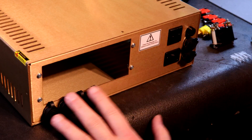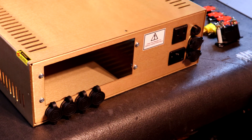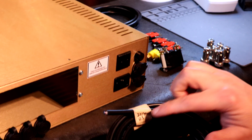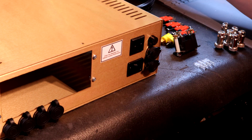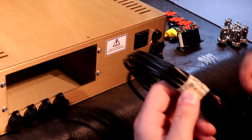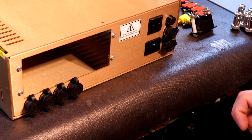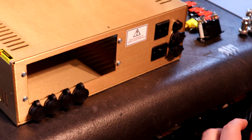You'll be getting all four GX16s on one side and the two GX16s on the other side, all with matching female connectors to fabricate your cables. Cable is included — you're getting the 20-gauge 5-lead double shielded for the VFD connection. You're also going to get 90 feet of my double shielded 22-2. This cable is super flexible and double shielded, and 22-gauge is optimal for use with switches mainly because there's very low power. We want maximum flexibility to get into those tight crevices and corners.